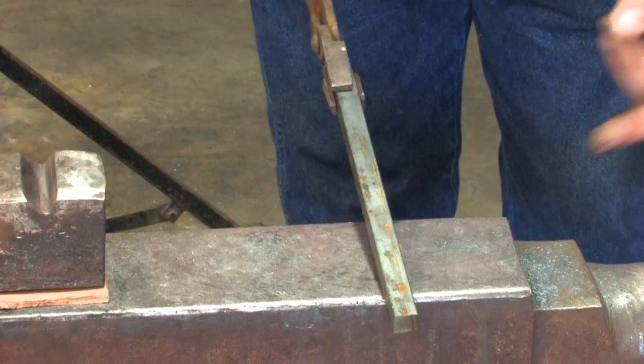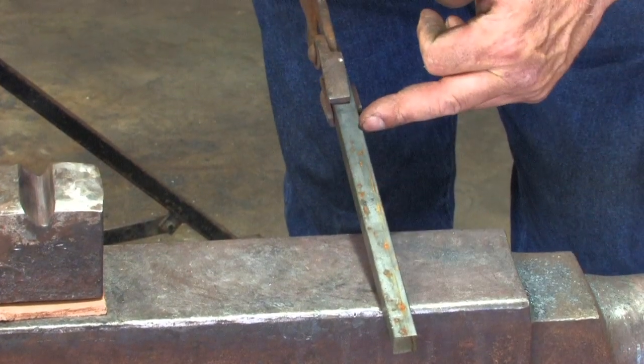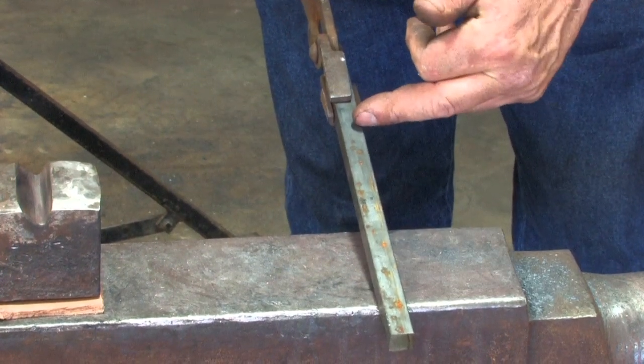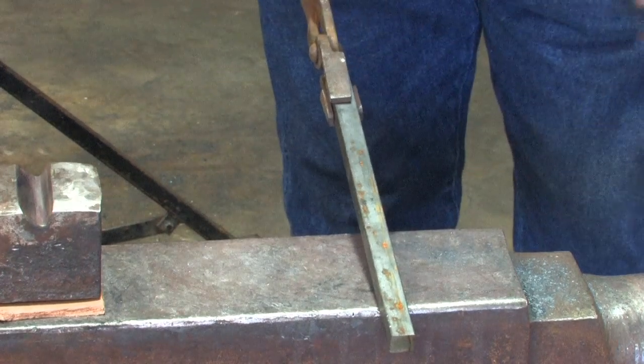So we'll go in with a thin one and then we'll just clean the fullering up at the end with a normal fuller. So our first heat now, we want to get about 3/4 of the length hot. That way we can tool past the center. So then when we have our transition, we only got to transition a short piece.